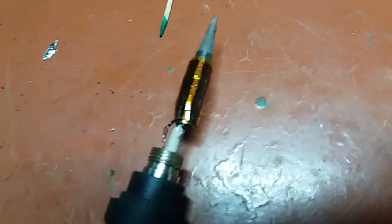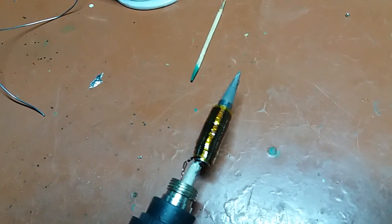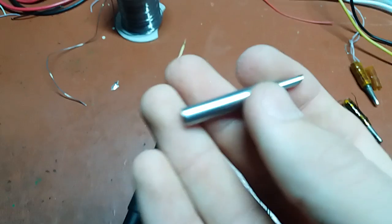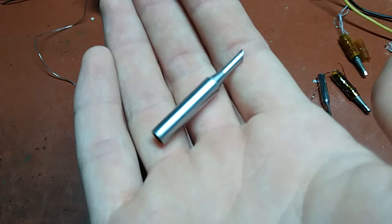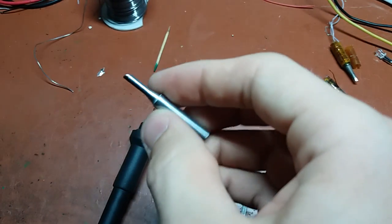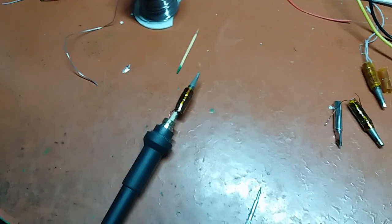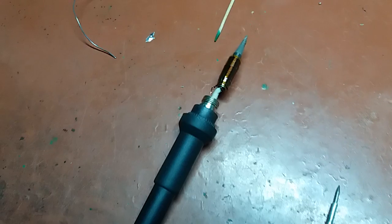This one is handmade. The work coil, as you can see, consists of 70 turns of wire, 0.5 millimeter in diameter, around the tip. It's for a Hakko 900M series iron, which you can find cheaply on eBay, and they're available in a large variety so you can swap them very easily.